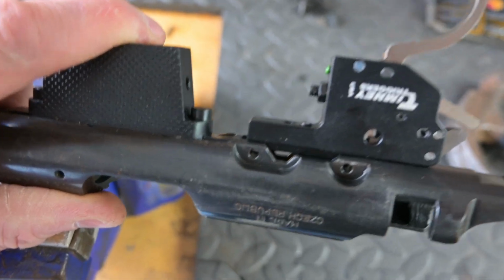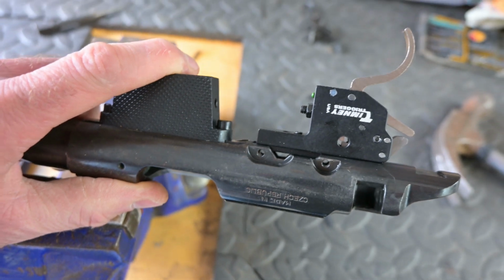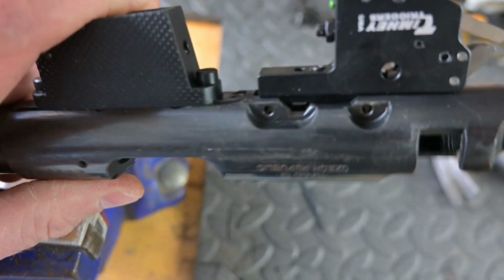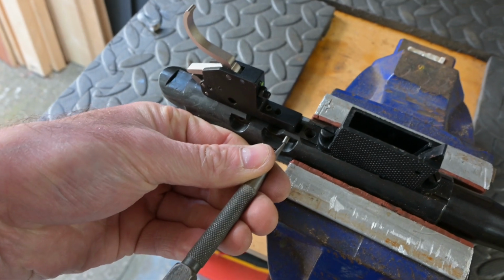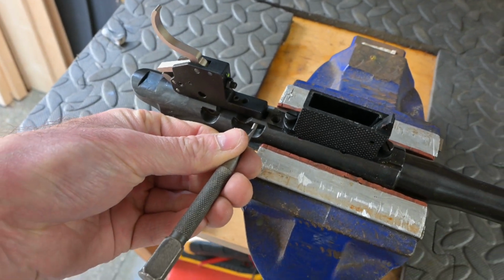So put the trigger in. We've now just got to align those holes and just put the pins back through, make sure everything goes in nice and neatly, and then we can tension that little grub screw down in there just to hold it snug against the steel receiver. Obviously I can't hold that pin punch while I'm holding the camera, and there isn't quite enough space to just fit that together, but you can imagine what's going on.